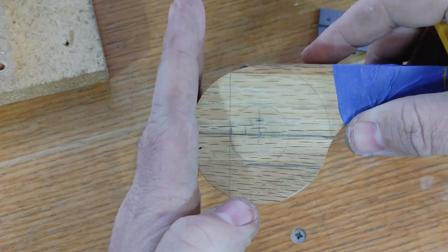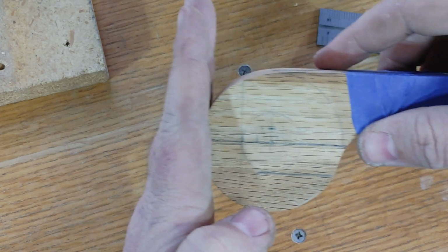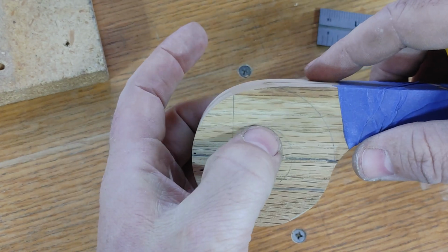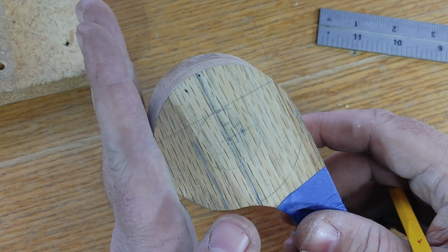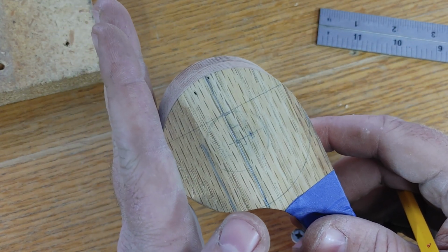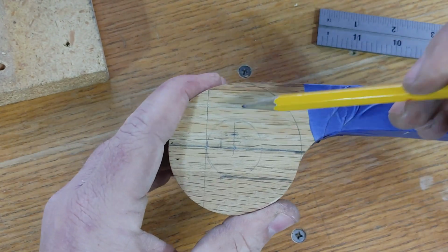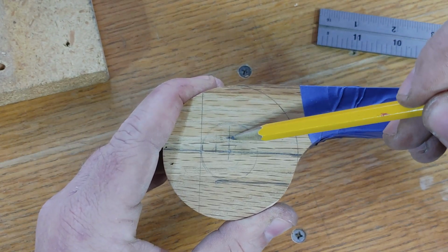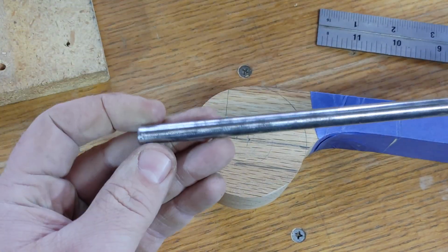So when it's straight up like this, there'll be no tension. And I slide the vise into my material, and I hinge it there, and then when I push this down, that will press the hinged portion of the vise up against the material inside. So there's the center. Here's where we're going to drill a 3/8 hole for this 3/8 rod.